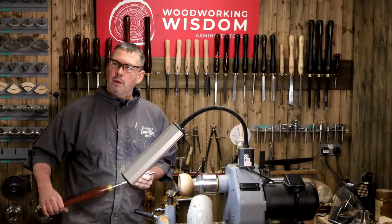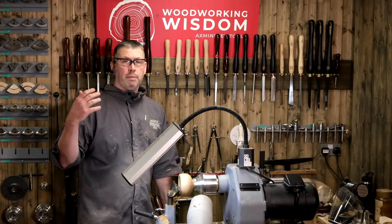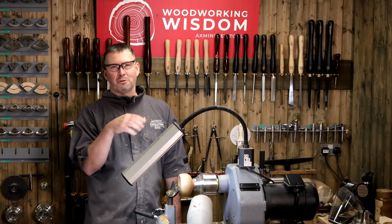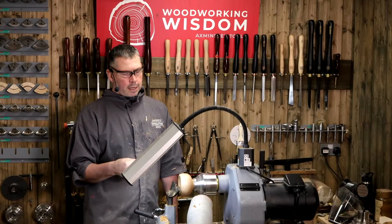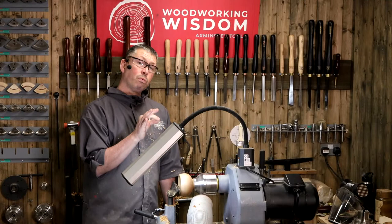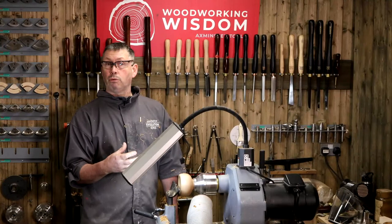Then Cliff's asking, what do you mean by stitching? Stitching can mean lots of different things. Butterflies in tables will mean little blocks of timber in a rough shape of a butterfly, more like dicky bow ties. So you route that shape out and put that in. Stitching in bowls would be either copper wire, brass wire, leather, nylon, all those things, literally stitched, either side of the crack and used as decoration or to physically hold something together.